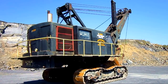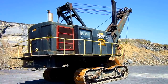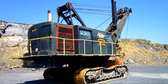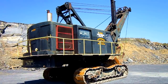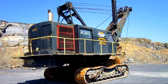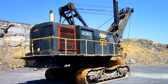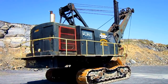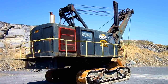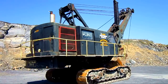The story of the legendary 88B came to a close in 1984 when the last unit was shipped and production ended after over 600 88Bs had been built and put into service all around the world. The overall operating weight of the 88B Series 3 in shovel configuration as you see right here is 135 tons. The earlier versions weighed around 127 tons as a shovel, the stripping shovel configuration weighed 163 tons, and the loading shovel configuration for the Series 4 machine weighed just under 150 tons.